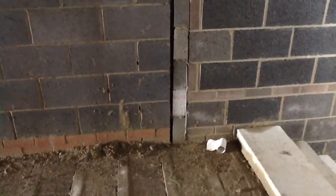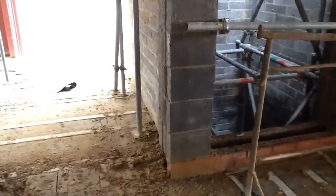Down the stairs to the floor below, and if you look at the bond across the pillar there, none of the walls actually line through from one side to the other. On this side it's on two courses at the bottom; if you go to the other side, it comes off a four block. And further along it goes back onto two courses — that's why nothing seems to be lining at all. All of which was done by other bricklayers.